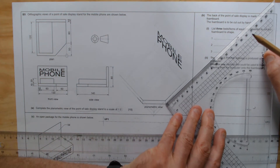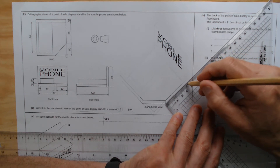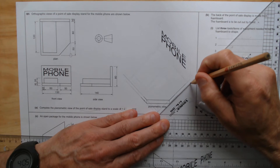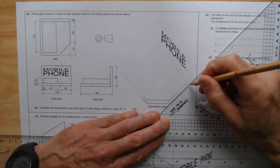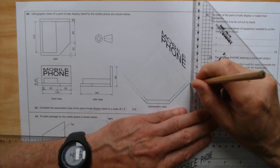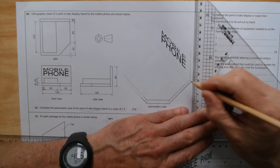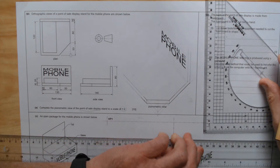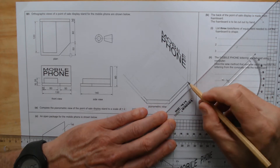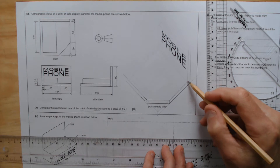So I'm going to measure from here 45, which is this point here, and then I'm going to measure a 5 millimeter back, so that will be somewhere there. I'm going to draw a line from there. So this would be our back line — line straight up. I remember I've measured that 5 millimeters there, so I can draw a line over there. Extending that line means it will meet at that specific point. So I've got a 45 here and I've got 5 millimeters back, and it gives me that point.